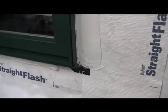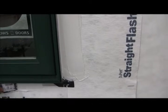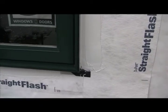This is a bulletproof method of window installation. Builders often ask about a bulletproof method, usually after they've been stung by a leak. The only way to supply that is with a buttered cap bead of sealant — particularly if you're using a wood window with a nail fin that pivots. This is starting to look really good. You've got great protection here from a siding contractor or carpenter who might nail trim around the window — a 2x4 trim with nails could go right through your nail fin. This sealant does a terrific job of protecting against that. If water gets behind the system, it collects in the pan and escapes at the bottom.